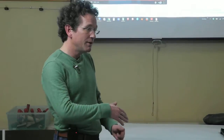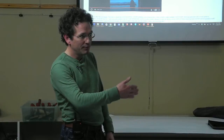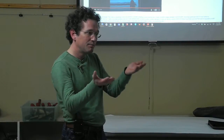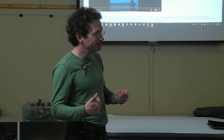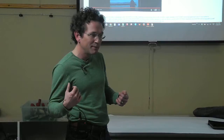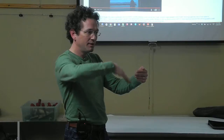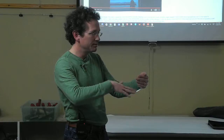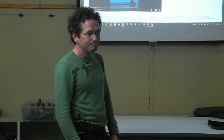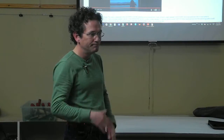Does it make a difference how deep you go? Yeah, for the whale-like propulsion, you really want the craft very far down in the water. For the fish-like propulsion, you can be closer to the surface because you're going forward because of the thrust fluid you're pushing back. And if you're at the surface and you're going this way, half of your tail cycle isn't getting any water. And so you're losing half your propulsive force when you get close to the surface in a whale-like motion.